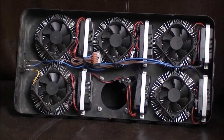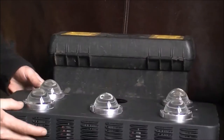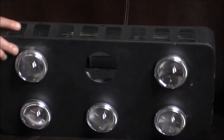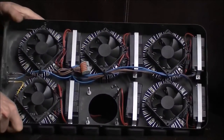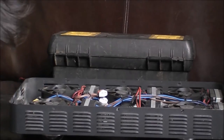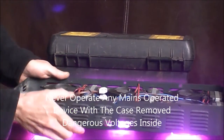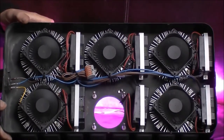What we've got for you today is a conversion on an old — it's not actually a Budmaster unit, but it's an old Budmaster style unit. I think this is a cheap Chinese knockoff. This video and the one to follow will cover the step-by-step dismantling and step-by-step conversion and reassembly process. You'll also have a few demonstrations. We see the original unit here. The on-off switch had failed and blown, and subsequently the unit wasn't working. The switch simply needed bypassing, so we ran it for a while to see how these red-blue units fare in the real-world environment before conversion. As you can see, we've got what should be six heat sinks, six fans, and six DC power supplies. It's quite a bright unit, but the camera wasn't actually ranging down as the unit was pointed straight at it — the camera was quite able to cope with the power of those lights.